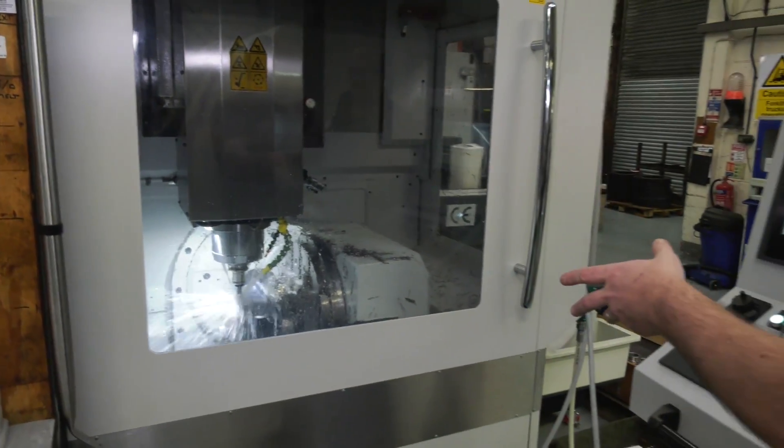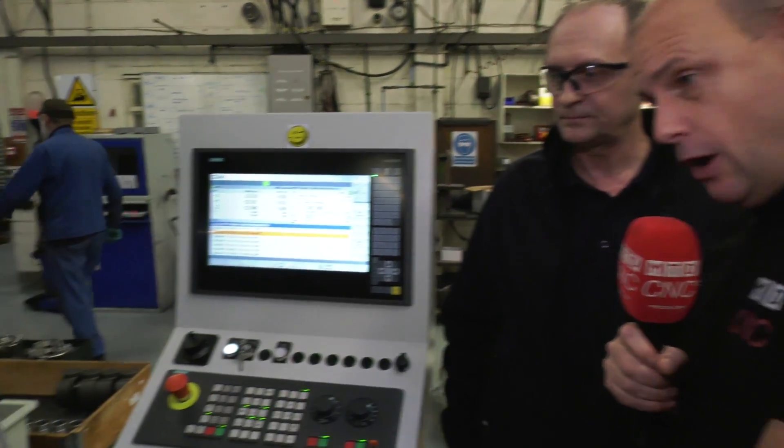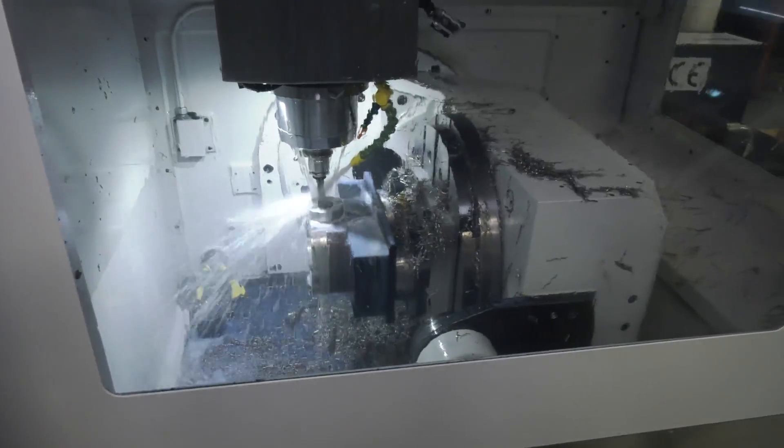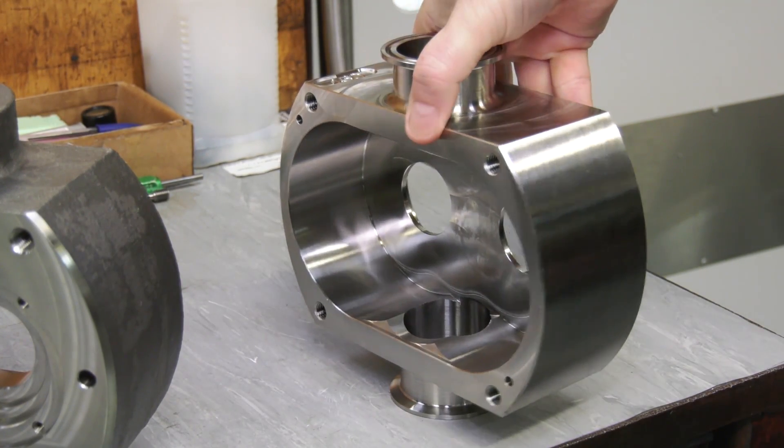This was an operation you were doing before on a turning machine, wasn't it? Yeah, both sides would be turned. Previously the pump body was done in five operations — two roughing operations, the turning interpolation you're seeing now, then finishing, plus a small op to flip the back off to get it parallel, so you're looking at five and a half ops really. Now it's a single operation — you're only handling it once, so there's less opportunity to scrap a part, and the machine works out every other datum for you when it spins round.